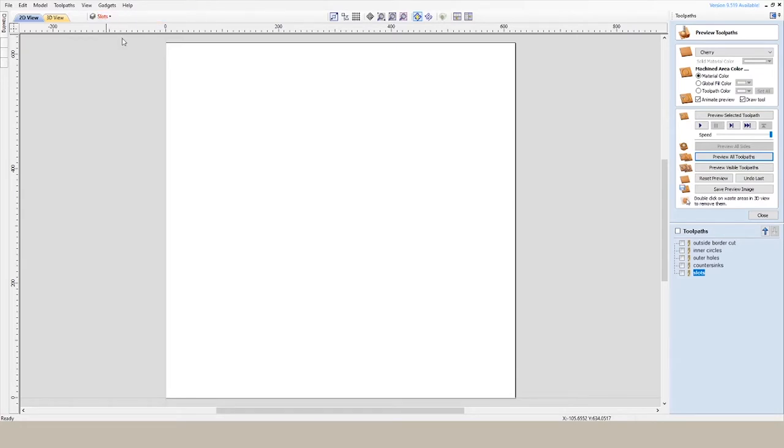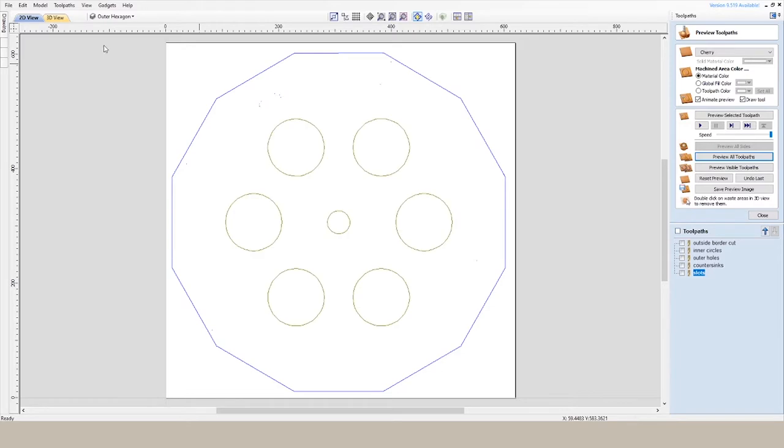It starts off with the outer hexagon in place, and then the inner circles, and then the outer circles. Each one of these are to hold in the linear rods, the spokes that go out to the end of the table. And each one of them is countersunk because the top of this needs to remain flat for the star to be able to sit down flush against the top.